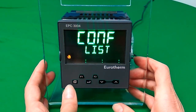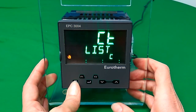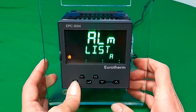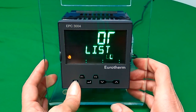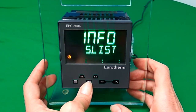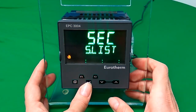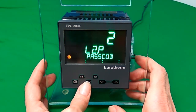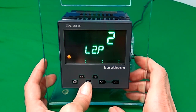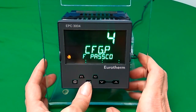Press the page button until 'inst' is displayed. Then press the scroll button, press the up button until 'security' is displayed, then press the scroll button until you see the required value, e.g. level 2 passcode, config mode passcode, or the warning message enable.